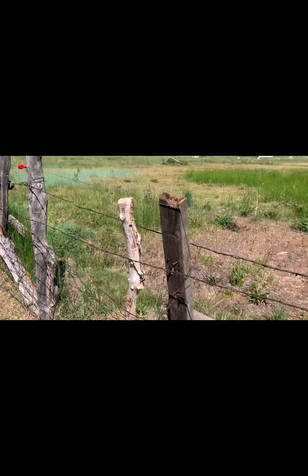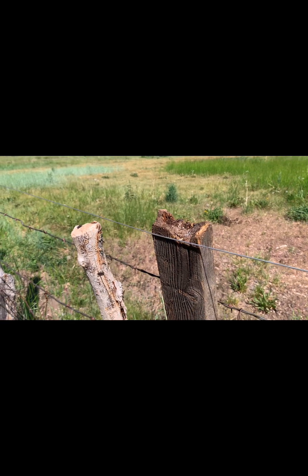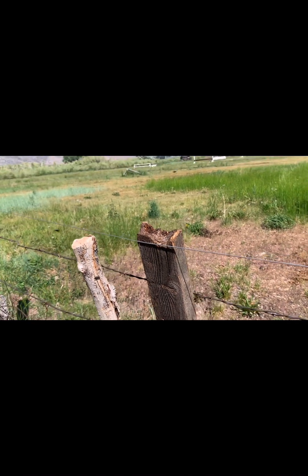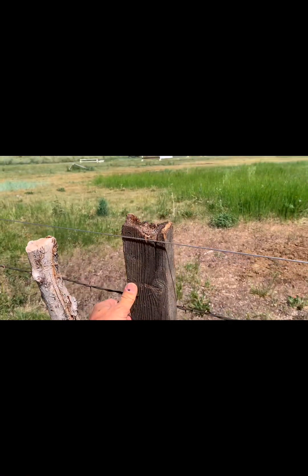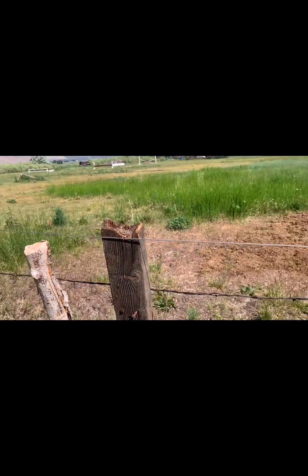And I found the fault right there — see how the wire is touching the wood? That's giving just enough, maybe with the slightest little bit of moisture in there, feedback that's telling me there's a fault. And there it is. I'll probably take my saw and just saw that off, and that'll fix the problem.